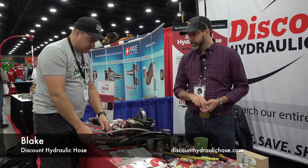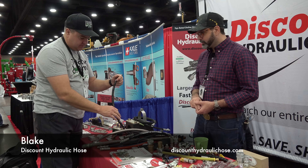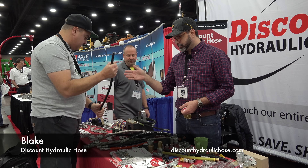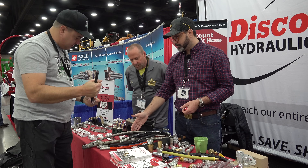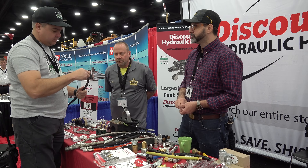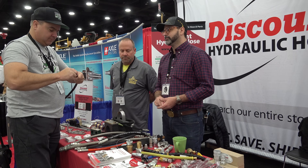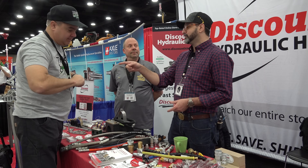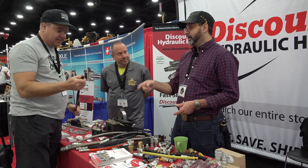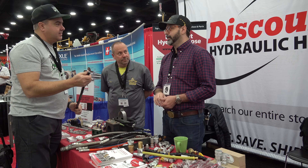Check out all these hoses. Wide range of hoses, whether it's regular hydraulic hose, thermoplastic hose, or PTFE hose with a steel braid - we do it all in-house, custom cut, crimped, and ship hoses straight to your door. Unfortunately, I would not recommend that end fitting on there because that is designed for your Parker or Gates machine, and you would want to use a three series fitting on that hose.